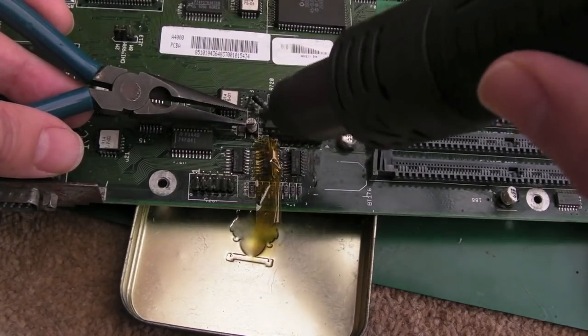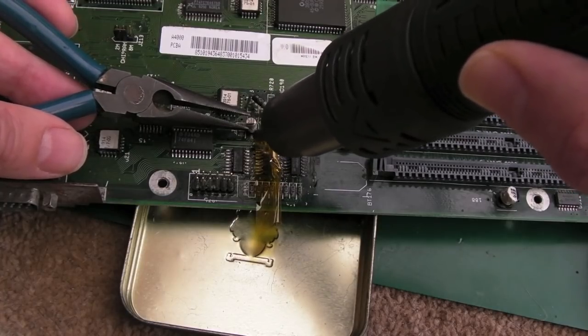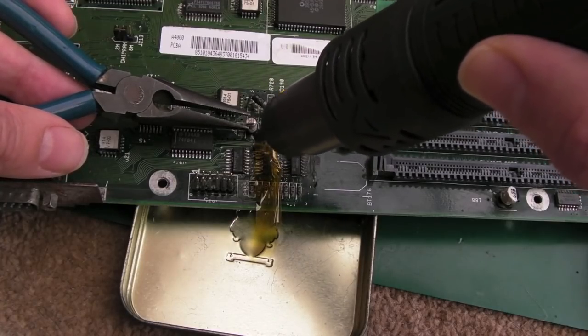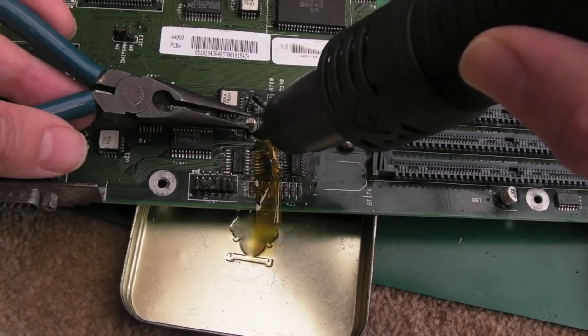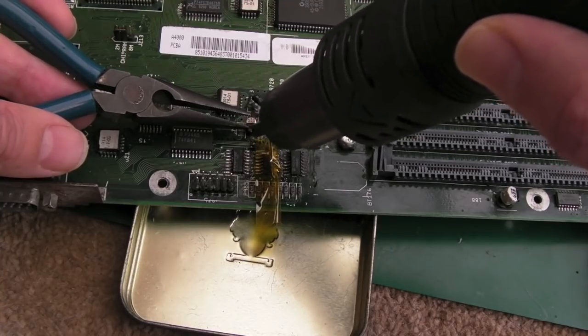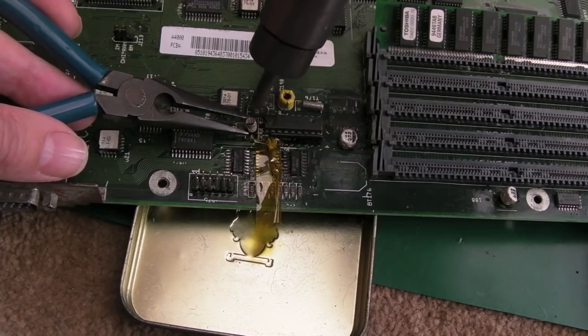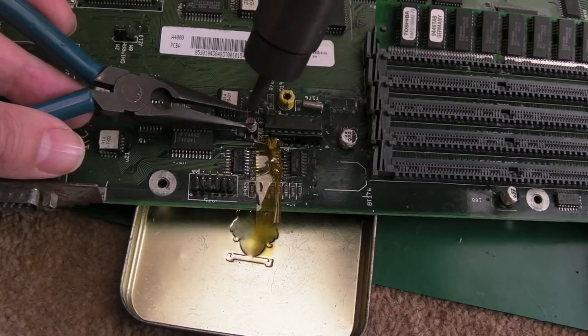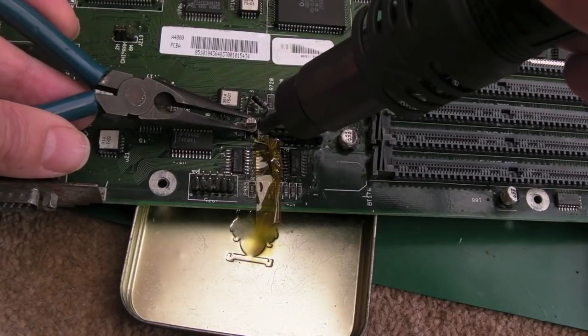And we'll do that after we've done all this stuff here, see if we can make sense of what's going on. Because it kind of started when I looked at the output enable. The output enable's just stuck high on the ROM. Now, that makes me think there's something going on with the ROM, but I'm not entirely sure at what point that ROM becomes enabled. Would the CPU need to spring to life in order to drive the address lines? So if you've got a clock problem, or the CPU's not starting up for some reason, then the output enable wouldn't come into play.